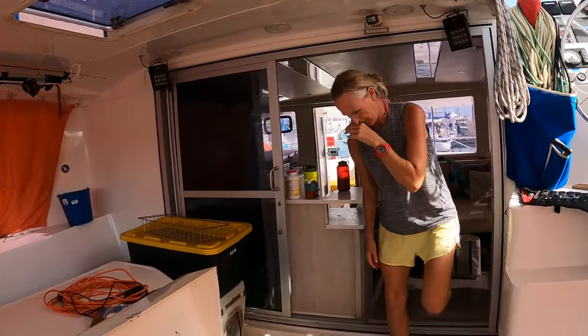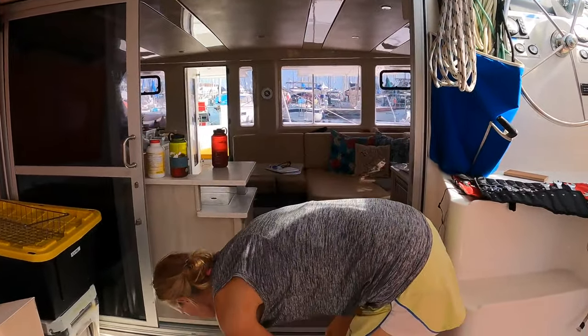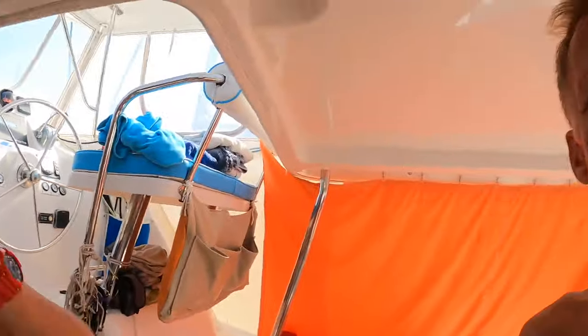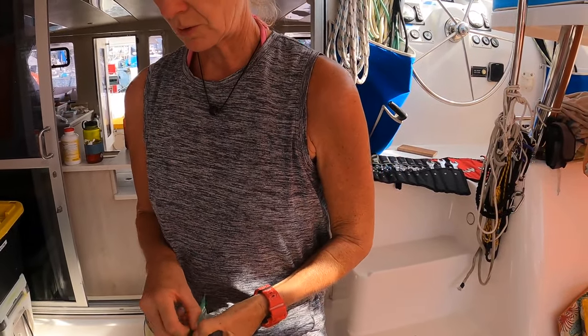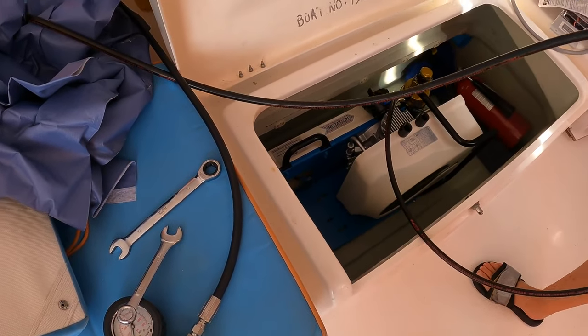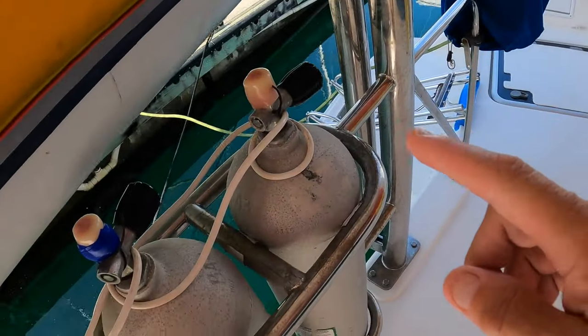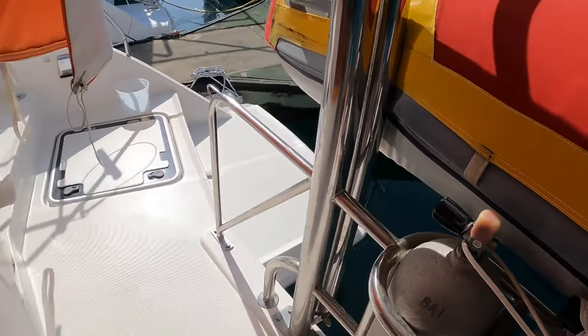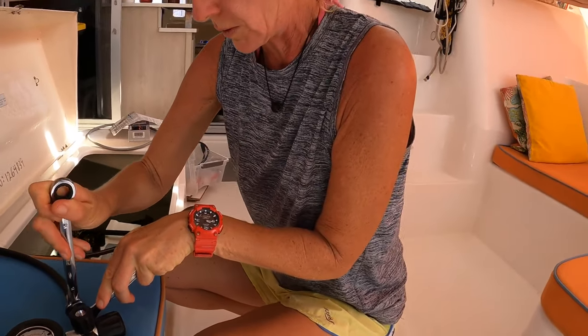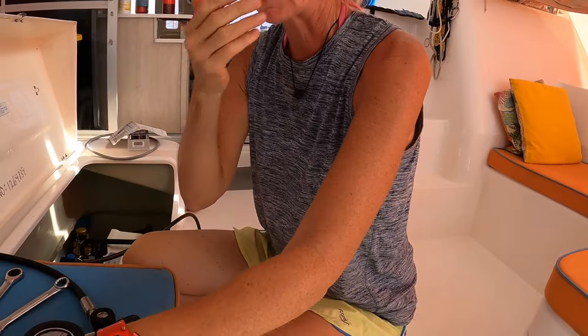Right now Eileen is working diligently — she gets a little bit of this engineering stuff from her papa. This morning we went to Balisa here in Panama City and picked up some hydraulic hose, 15 feet long, so that we can extend it over to our tanks as they're sitting in their compartments. I am tightening the fittings on this. It was a little bit complicated to change out the motor because our 110 motor has a shaft size of 16 millimeter and our 220 motor had a shaft size of 24 millimeter.